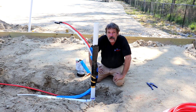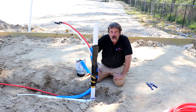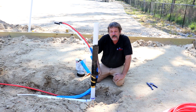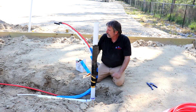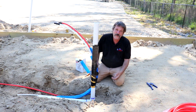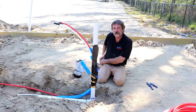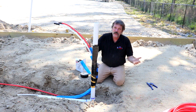That's pretty much it. That's the only water lines we got to run on this one because of the island sink. Just remember: you've got to sleeve it where it touches that concrete. You don't want anything touching this stuff and you don't want to get primer on it — that purple primer you use for the PVC — because they say that'll eat through it too, and I know it'll eat through the poly fittings. But that's it — you bed it down, you finish your test. You don't really have to do anything with these unless you had a fitting on it, then you've got to sleeve the whole thing and put a pressure test on it. That's just one more thing, and a lot of times your slab people aren't going to be running around with a compressor because they don't need it. But that's it for your water lines — thanks for watching.